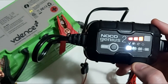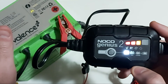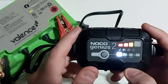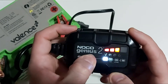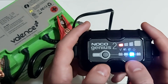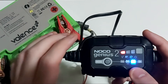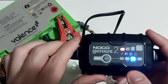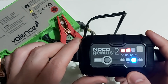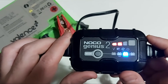The main reason I bought this charger is to charge this 12-volt LiFePO4 battery for a solar project I'm working on. I also have a couple of 6-volt sealed lead-acid batteries to charge for a different project and for my scooter. Once you set the battery type, it remembers — you just set it and forget it. You can leave this charger plugged in all year round and it will charge and maintain your battery. No need to buy two separate chargers when one handles both 6-volt and 12-volt.